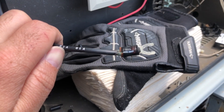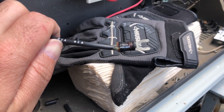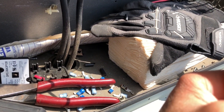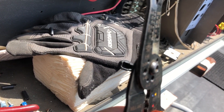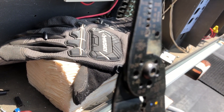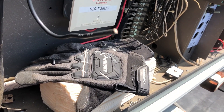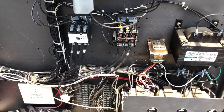Here's a little tip: when you have a wire like this that you need to strip — we cut the head off, and the jacket of the wiring is actually shrunk and stuck to the conductors. What you do is give it a cut, then take your strippers or linesman pliers and squeeze on the jacket where you're going to strip, on all sides. When you do that it'll strip and slide right off. If you don't, it's going to be a pain because it's literally melted to the conductor inside.